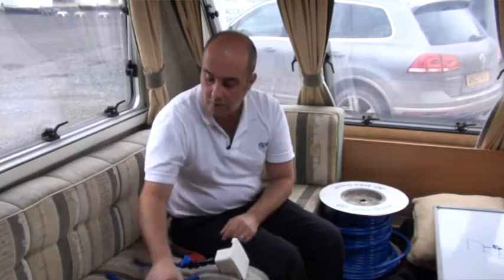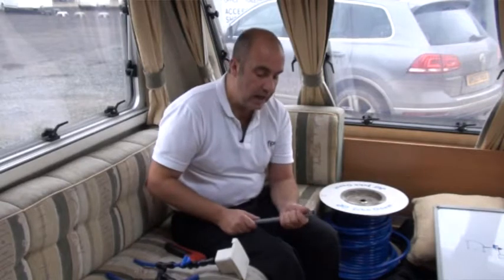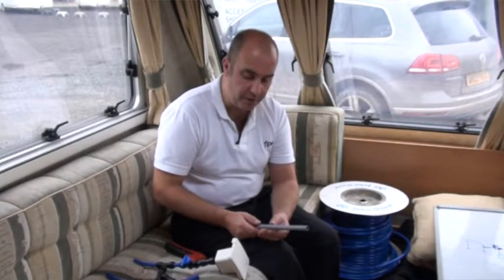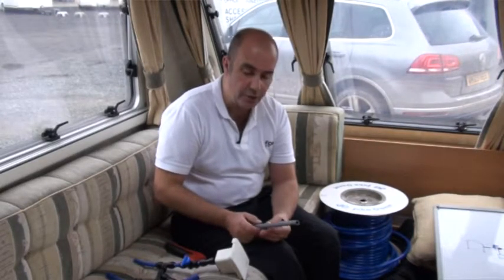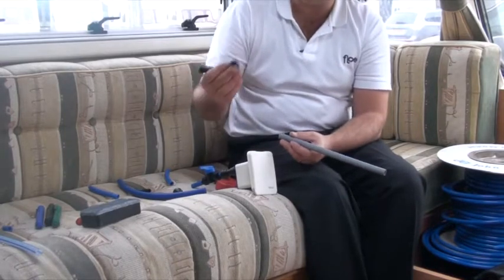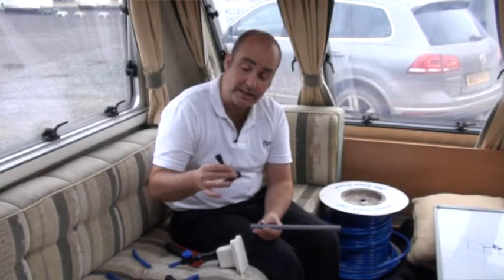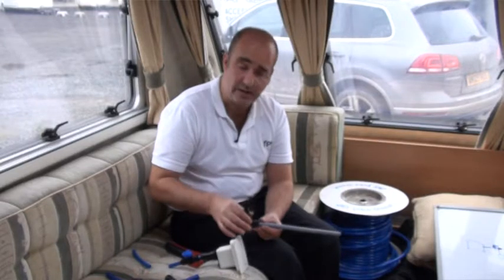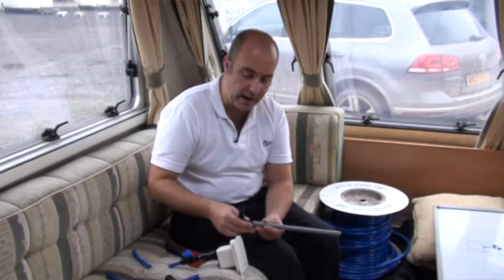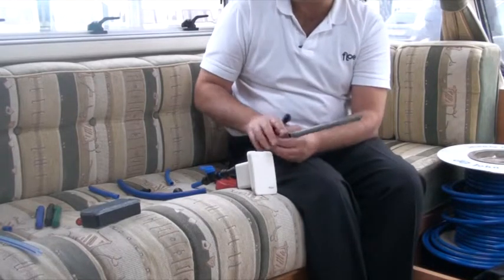Also, some properties use different pipe sizes: in the US and Canada, half-inch pipe is common; in the UK it's 15mm; in Europe it can be 12mm or 14mm. A lot of marine vessels use 15mm domestic pipework. We supply 12mm because 99 times out of 100 that's what you'll have. However, we also have this T in a 15mm version and other sizes. In the troubleshooting section I'll show how to exchange it — the 15mm version works for copper, grey, and white Hepworth pipe.